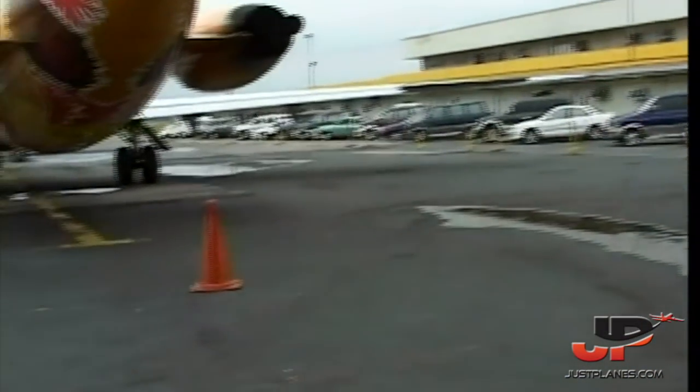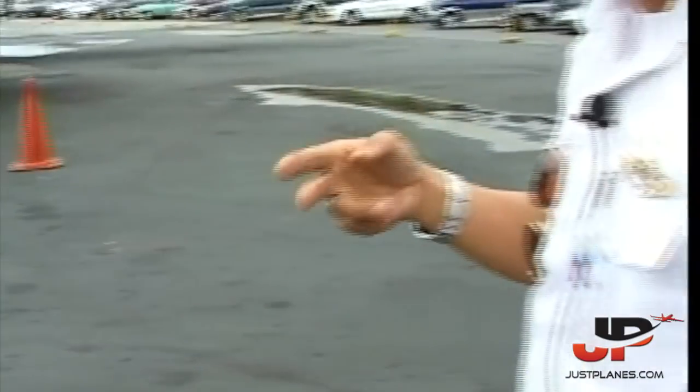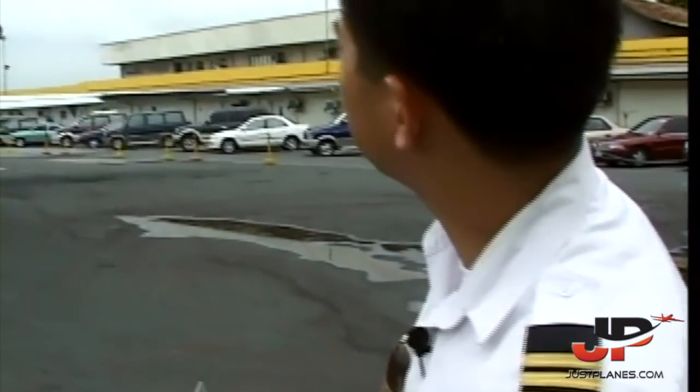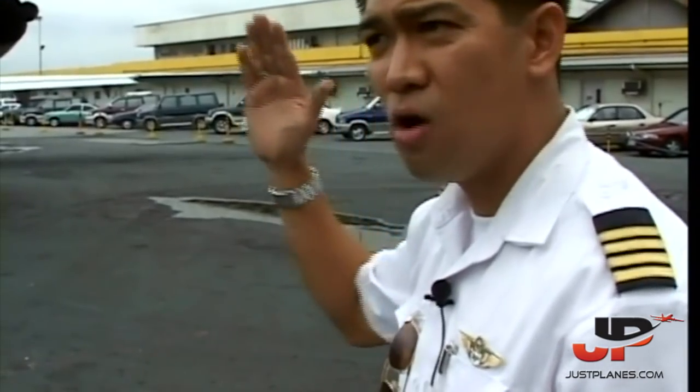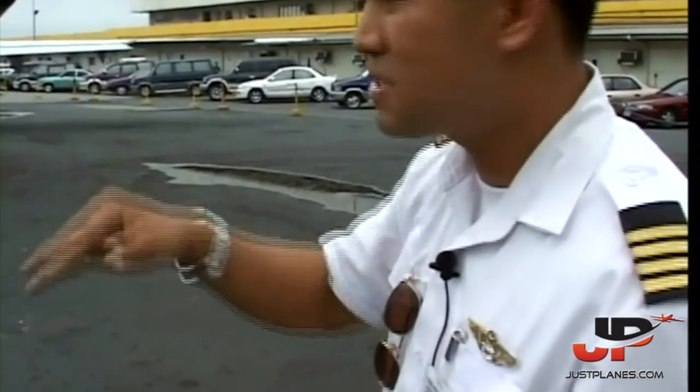However, if you do need a lot of down elevator, we have elevator power, like what I showed you earlier in the aircraft. In case you're approaching a really deep stall, so you get enough elevator authority to give a pitch down to avoid a stall.